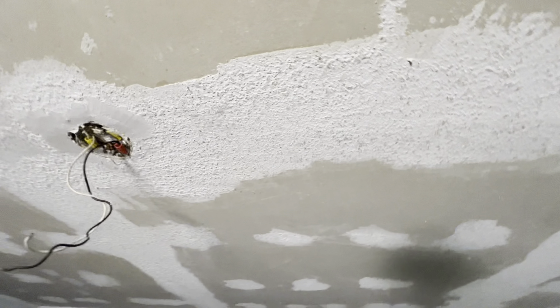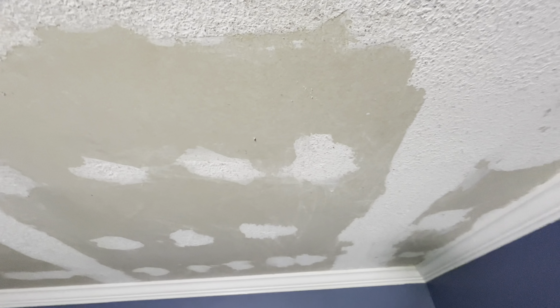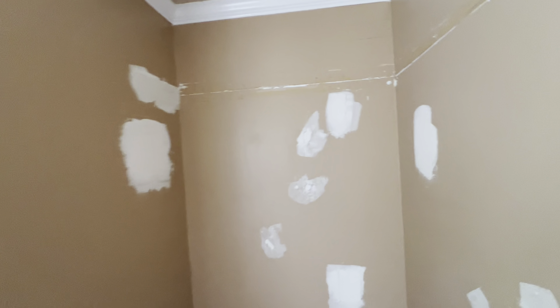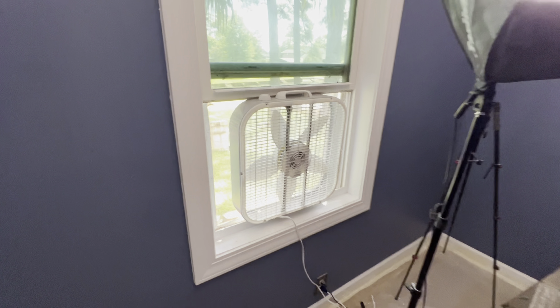It's time for me to have some fun — and by fun I mean I am going to be sanding the ceiling. As you guys can see there is still a lot of texture where the seams are in the ceiling and these are the nail holes where they screw in the sheetrock. I also repaired all the damage that I caused when I scraped the ceilings. I filled up the holes everywhere, so now it's time to sand all those rough texture spots and see if we can get this ceiling all smoothed out. This is the ceiling in the closet — I got everything filled in with joint compound so I can sand it and see how smooth we get it. I'm going to do some finishing mud on the walls but for now I'm going to sand this ceiling. I've got a box fan in the window to hopefully draw out a little bit of the dust. I'll throw on my mask and then start sanding and show you guys a smooth ceiling.